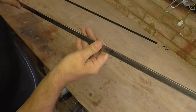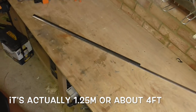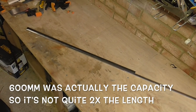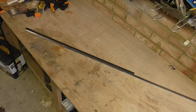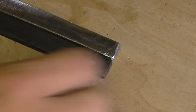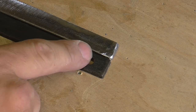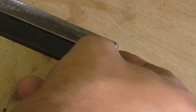This bar is 1.2 meters, so it's twice the length of the existing bar. I'm going to make it fit the clamps, effectively doubling the clamping length available. This is the new bar, and this is the existing bar from the clamps. As you can see, I'm going to need to drill two 5mm holes in each end. I'm going to use the existing bar as a template and use my drill press to drill the holes.